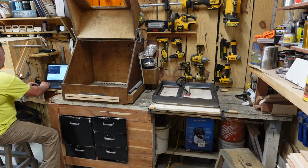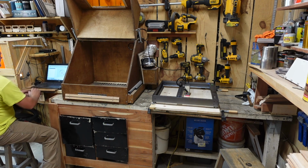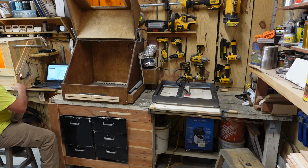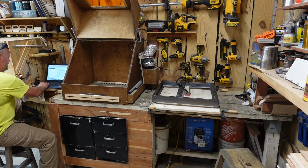I'm opening the Home Sweet Home stove cover file. And the way to get this thing centered, guys, is you want to select the entire graphic and then click on the crosshair with the red dot in the middle, and that is going to move it to where the laser is. Center it on the laser's location. And so that's centered on the laser's location.